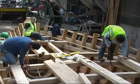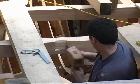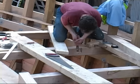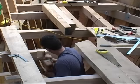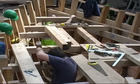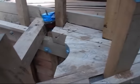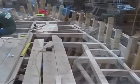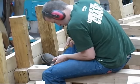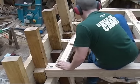Joints are cut on the deck beams to take the carlings. The breast hook is in place in the bow. Work continues to complete the deck beam structure. Carlings are fitted between the deck beams.